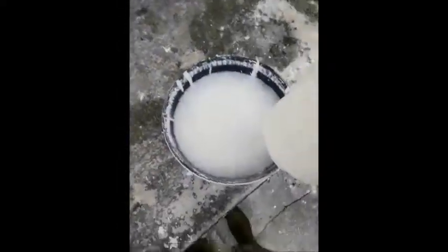So now there are three litres of paint in this bucket with a water mix. I'll pause the phone, put in some water, and fill it to the top and mix it. What I actually do with the jug is put it into another empty paint bucket and let it soak until next time — there's a way of dissolving the paint because that paint kind of sticks to the jug, so it's important to keep the jug stored properly.